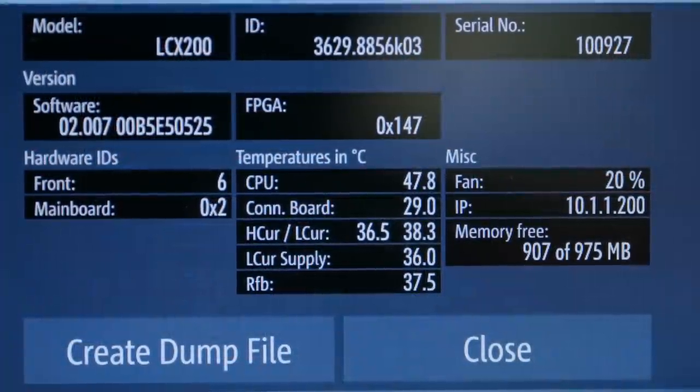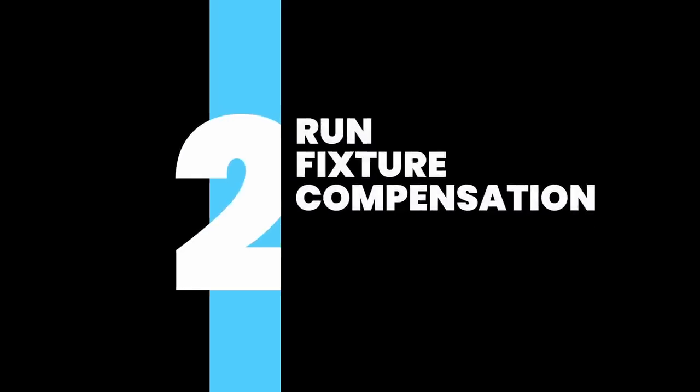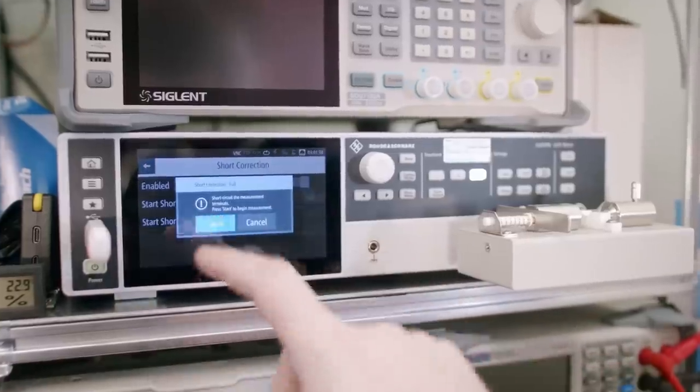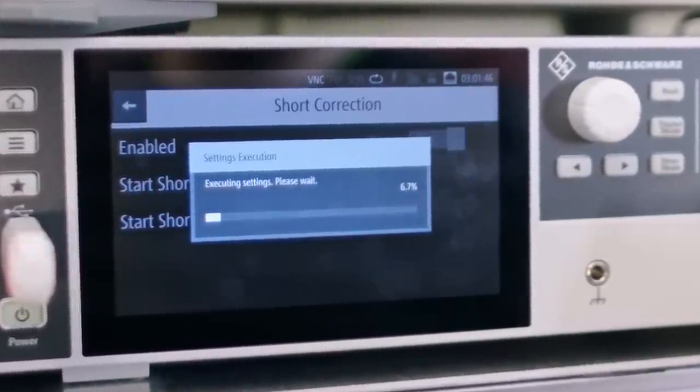If you're just getting into LCR meters, here are a few tips to get you started. First, give your meter a chance to warm up before running compensation or comparing components. While the meter should handle its own temperature change well, it's best to give it some time to stabilize to ensure you get the highest precision measurements. Fixture compensation is used to correct the parasitic capacitance and inductance introduced by the test fixture itself — particularly important when testing high-frequency or high-impedance components. Ensure you have run compensation for your fixture before taking any measurements.